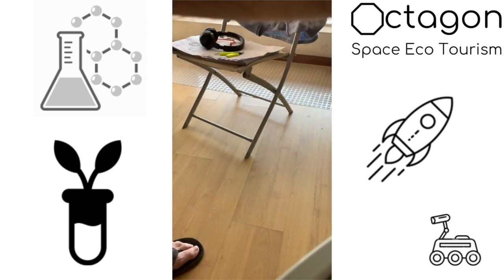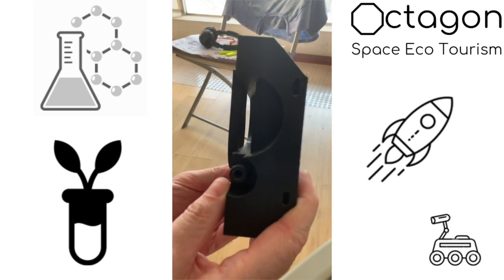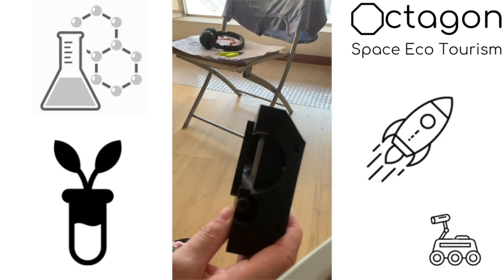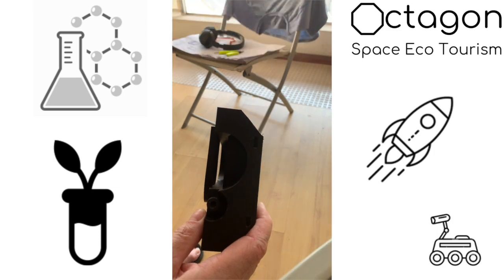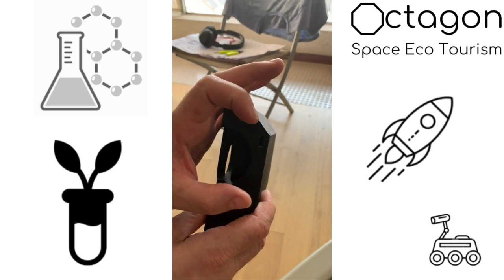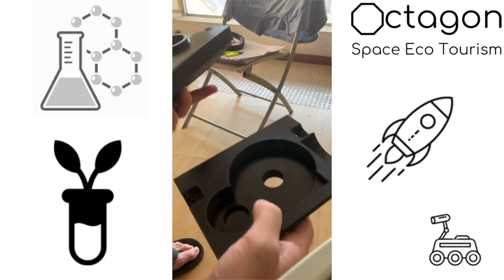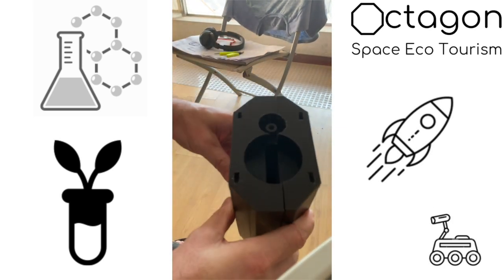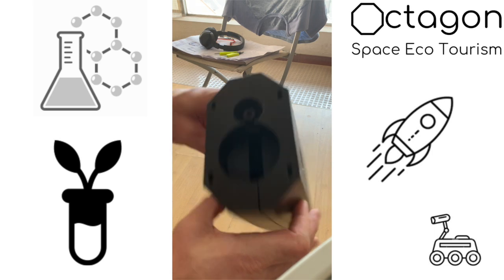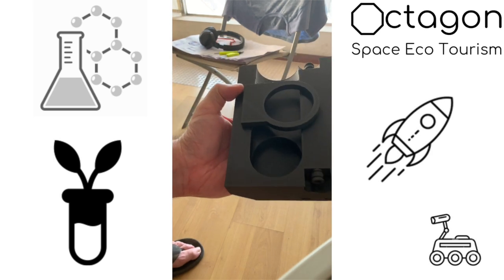But before I do that, I just want to talk about the crankshaft one more time and just focus in on the slot that it fits in. So we can see here we have a box that is actually the actual width of the crank arm. And if we're looking at keeping the piston orientated, obviously the cylinder head does all the job, but obviously we're taking advantage of the crank arm. So if I put the two boxes back together, you can see here that I've got a slot in there where the crank arm is free to travel, and that comes down at the same diameter to these guys over here. Fairly simple design.